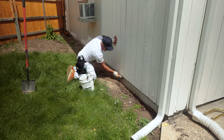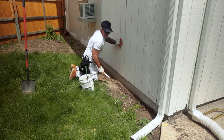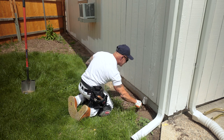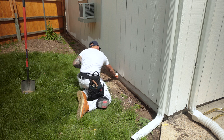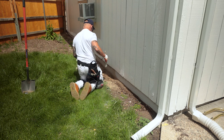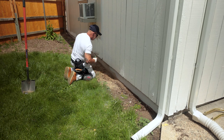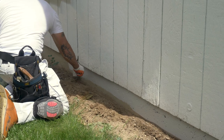You could spray the house first, get overspray on the footings if you knew you were going to paint them, and then you wouldn't have to shield the footings — or you can do the footings first and then shield them, whatever you prefer. Back here where the footings are a little bit taller, I'm going to be a bit faster because I can actually roll it. I typically do this any time previous painters have gotten overspray on the footings. I really like my footings to be footings, painted a concrete color — beige is one I use quite a bit.